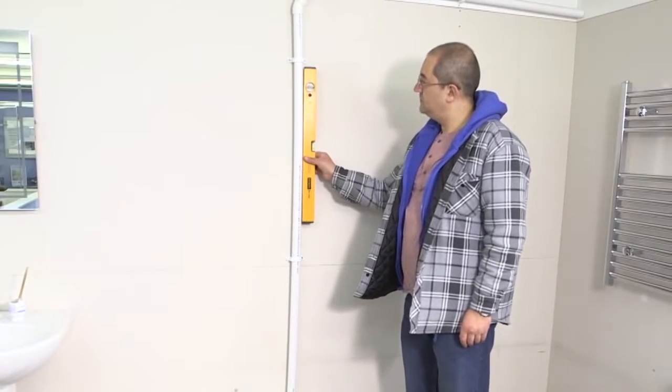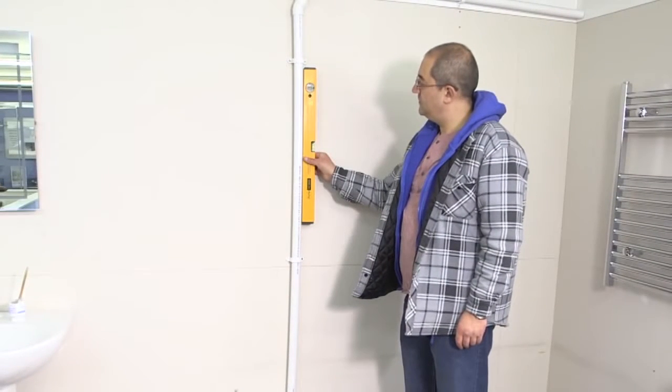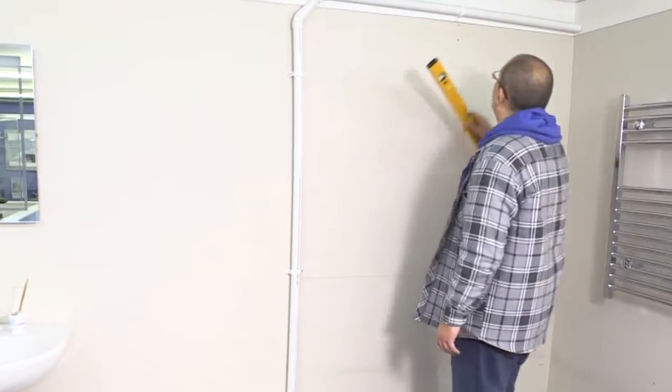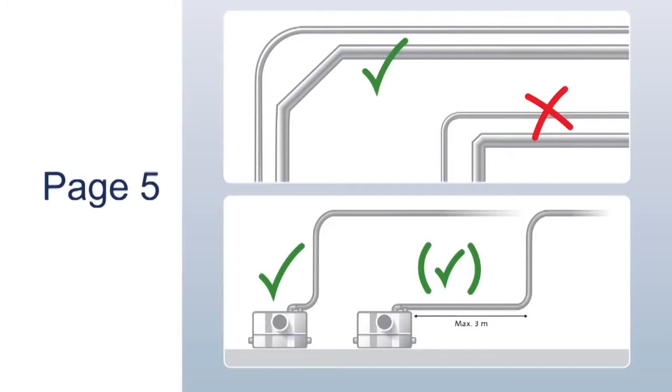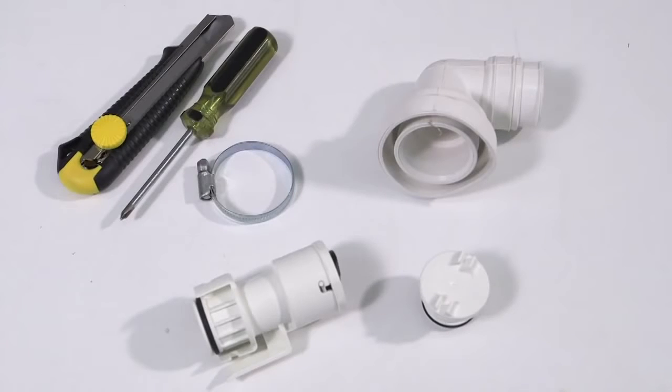Install the outlet pipes securely, ensuring that you use the correct bends and necessary fall, and connect to the soil stack. Please make sure you refer to your manual for recommendation for bends, distances and fall of the discharge pipe. The Sololift2 outlet connection consists of these components.